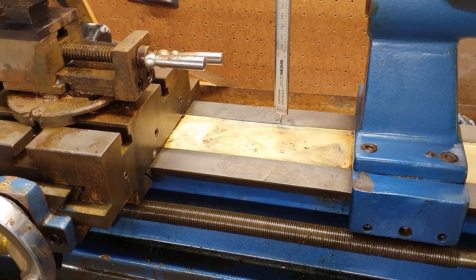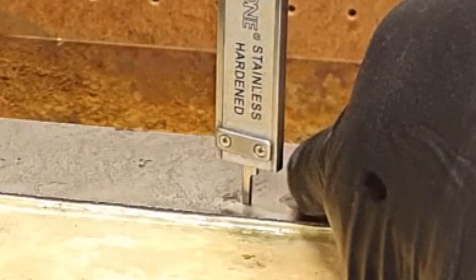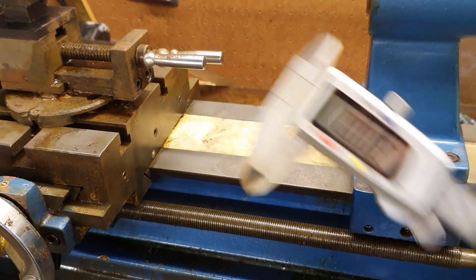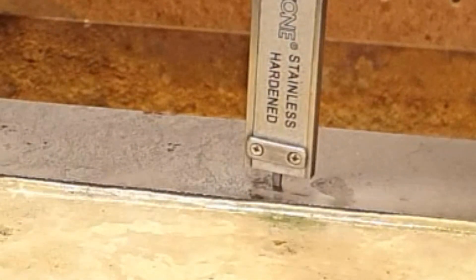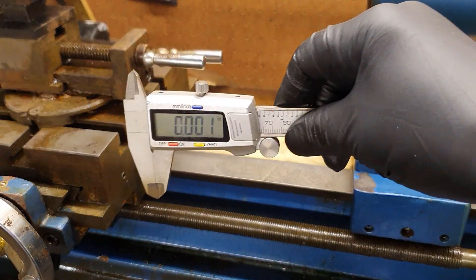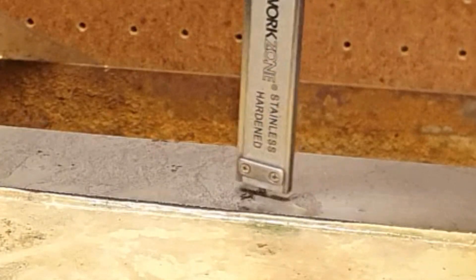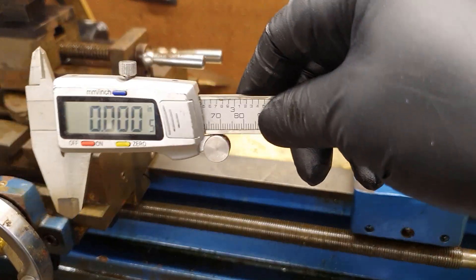I'll put this on a good shiny piece of steel, and just beyond it is the major rusted area that I've currently got left. I'll bring it down onto there and see what I can find out. That's about two thou — one and a half to two thou. Second test: one thou. So this isn't an accurate test, it just gives us a ballpark figure. The mound of rust was about six to six and a half thou at the start of this process. I don't think it's too bad now — we've got it down to about half a thou.